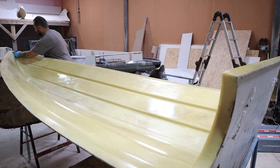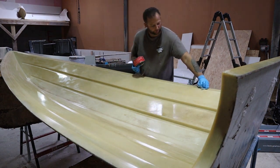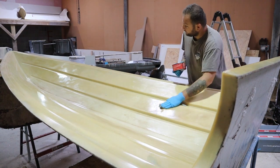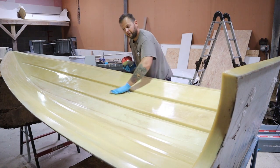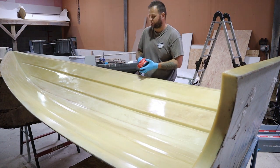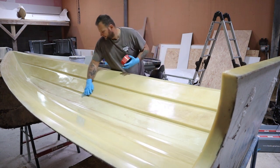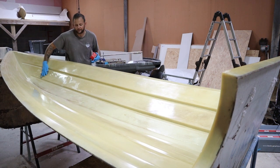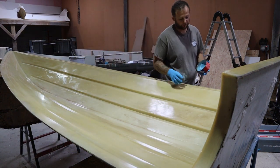Okay, so that's pretty much this side done. I'll check over it again, get the transom done on the other side. Repeat this process another 6 times after polishing it, and even for polishing it, we just want a dry rag. Again, we use 20 kilo bags of rags because they're cheap, they're disposable. Once the rags clog up with wax that you've polished off, they become pretty useless other than cleaning up a mess off the floor because you've dropped some resin or you've tripped on something.